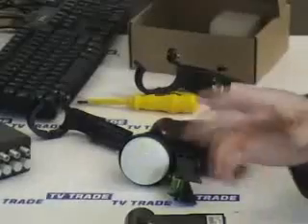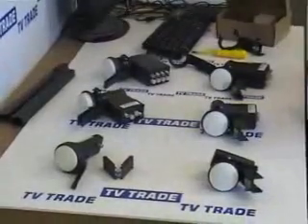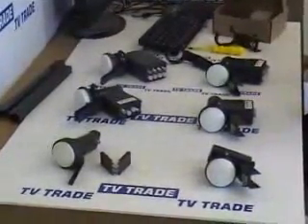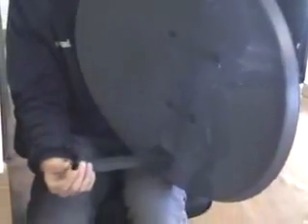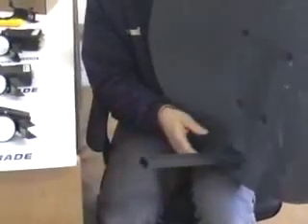That's the case for both quad and octo LNBs, although we still do have a certain amount of single LNBs in stock which you can simply specify and you don't need to buy a legacy adapter for. If I just show you the basic design of a Sky dish, on the back you can see the bracketry, the elevation bracket, and those U-bolts are used to clamp the dish onto a bracket that is mounted on the wall. And on the front of the dish, at the centre of the circular dish, we have an LNB which picks up the signal and runs the signal from the dish into the satellite box inside.